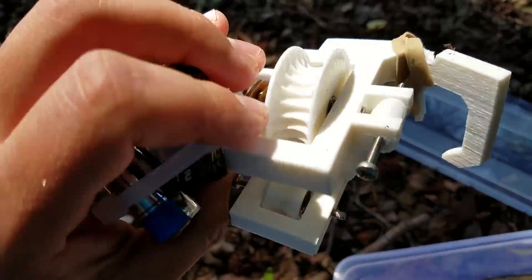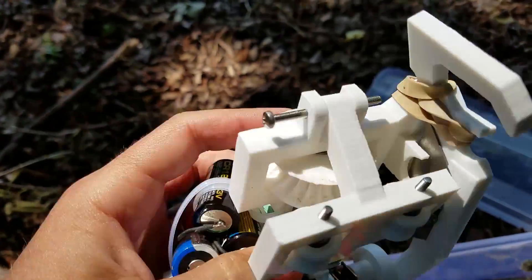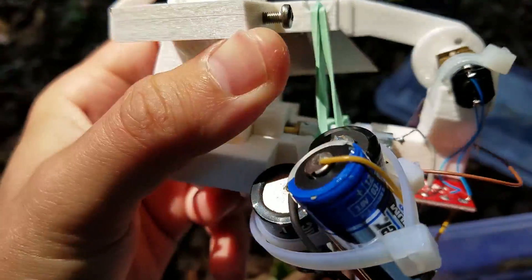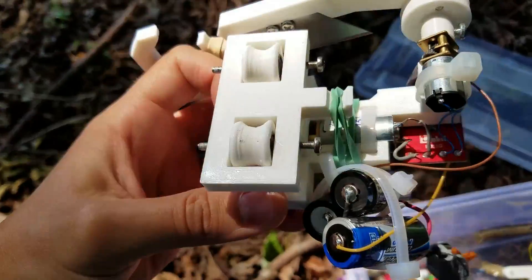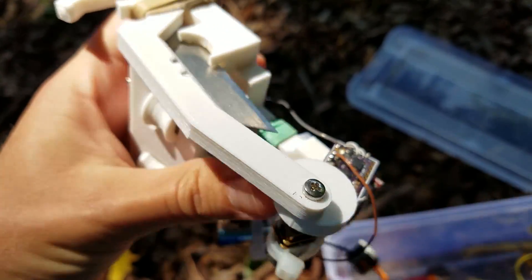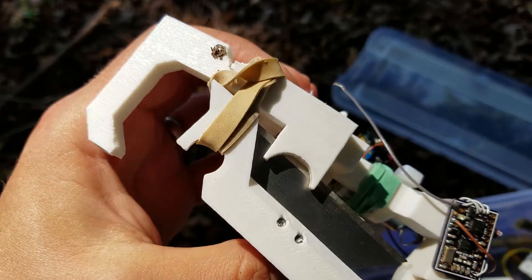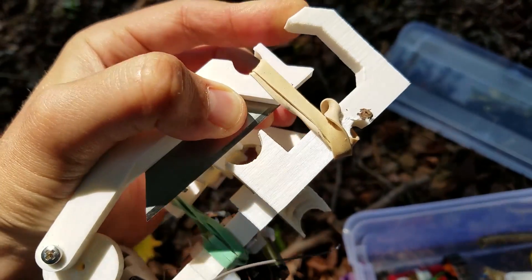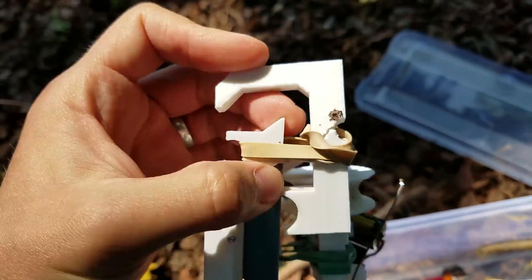The way I designed this is it has one of these larger gear motors turning this toothed pulley with two smaller guide pulleys that use rubber bands to tension the rope against that. And then I have a smaller gear motor turning a cam here to just move this utility blade back and forth with rubber bands to put tension on that. This was kept off of the rope until that motor was turned on by that little stick there, but that broke off in the fall.